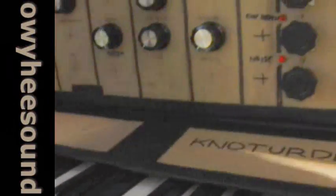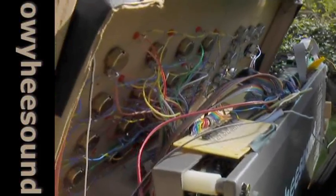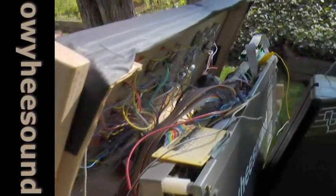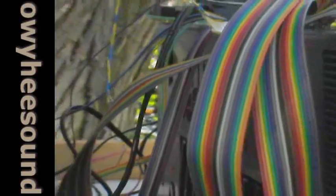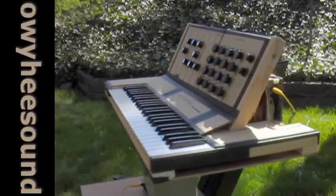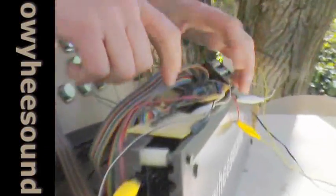The synthesizer bits will look familiar to some of you — it's actually a CSO-1. These are the slider knobs for each of the functions on this keyboard. The CSO-1 claims it has a VCO, but it doesn't — it's actually a digitally controlled chip, which is why it was so easy to put a MIDI kit on it from Highly Liquid. The rest of the controls are typically just variable pots — potentiometers and sliders — and I actually bypassed all of them: either desoldered them or scratched the trace out on the circuit board, then replaced them with the same pot value in a rotary fashion to make it more like a knob-type pot — like a Moog or Synthesizers.com sort of tactile interface.